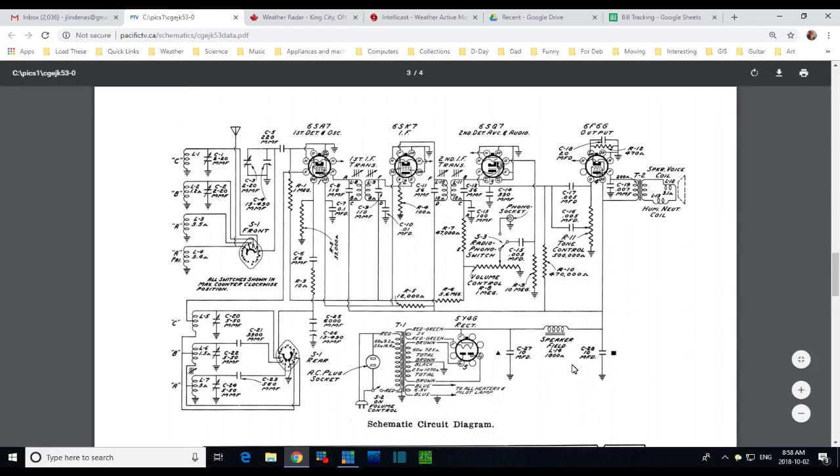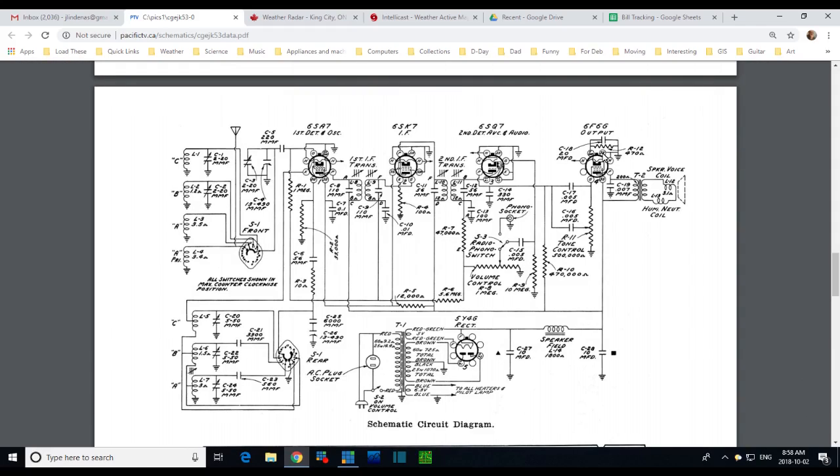Okay, that's done. Next objective is this capacitor and a look at this resistor, which are on pin number 8, coming off the cathode pin. Pin number 8, both going to ground. And the shield, what is that? SH. Shield. Is there a shield in this tube? Let me just take a peek at it. Where is it?